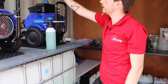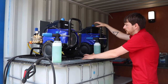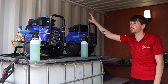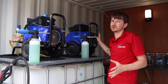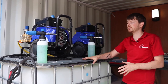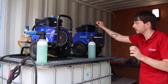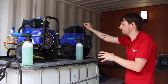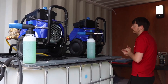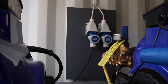Electrics are straight wired - happy days. Now, these machines will suck from a barrel, which is what the customer wanted. I tested the site before they opened and the mains supply wasn't going to meet the 11 litres per minute per machine requirement, so it had to have a dedicated water supply. The IBC was the handiest solution. Once the air has gone out of the system these will suck from the barrel. We've drilled two holes straight into the IBC with a weighted filter to make sure it's not gathering any grit, plus a normal hose-lock quick fitting.